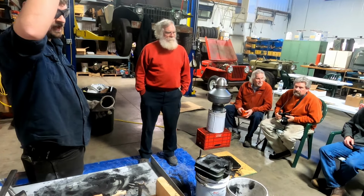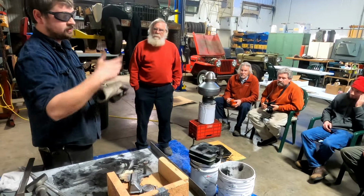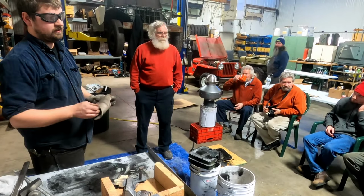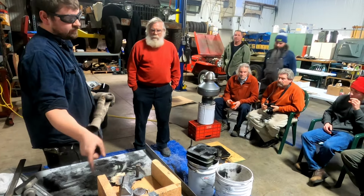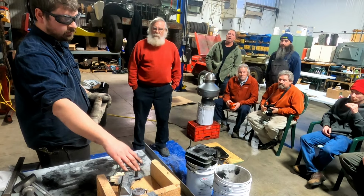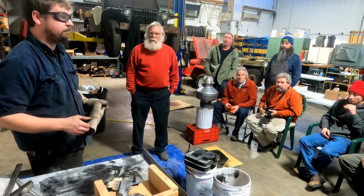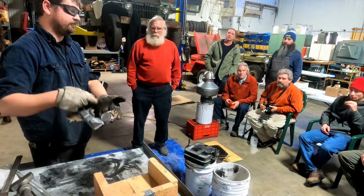So when I do 6-on, I have the same length there, and I go a few more, but it gets a lot higher yield, more efficient. You run into 6 gates. Yeah, but it gets way more efficient. So I run one off of each side of the feeder. So in this one, this is about 3.5 pounds of total pour weight for about a half pound to 0.4 pound part. So the yield is garbage on this. I'd go out of business if I was doing this professionally. You'd get fired, right? Yeah.